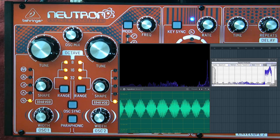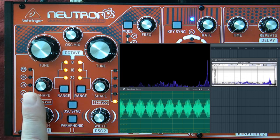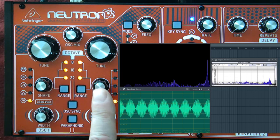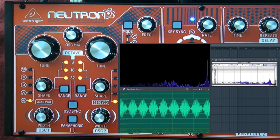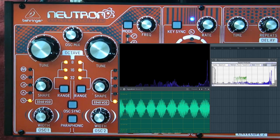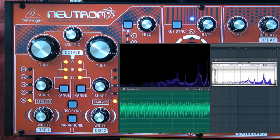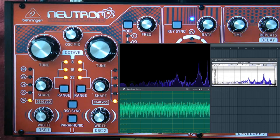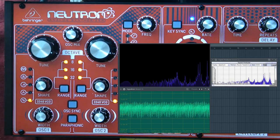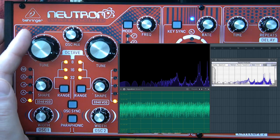So we don't hear anything because the frequencies are too high. Now I let oscillator 1 modulate oscillator 2. I have to use the patch bay to do so. So you won't see this at the moment. And suddenly there is something audible again. Two frequencies, both too high to be audible, modulating each other, will from time to time result in audible frequencies.